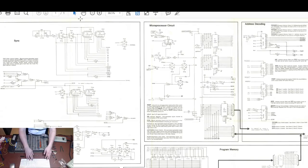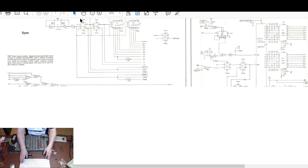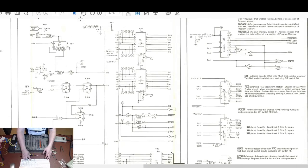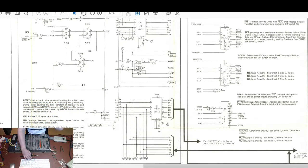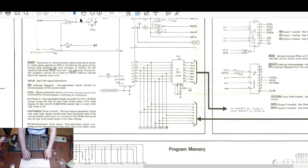So over here, microprocessor clock. So that's all your clock circuits. I think we're fine there. Microprocessor. Here we go. So here's a 6502. And it's telling me, if I press the thing again, now it says OK. Well, there we go. If you press it a few times without touching the board, it'll keep going between various data bits. So what we do is we look at the bottom here where we've got data, and specifically this section here. So my guess is going to be that we're going to have a short...